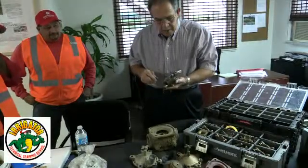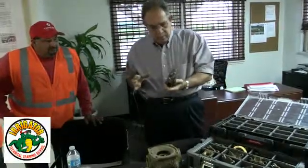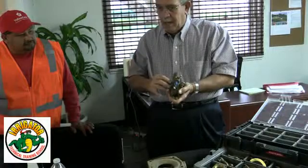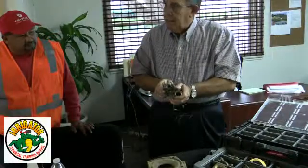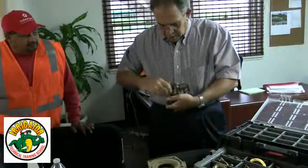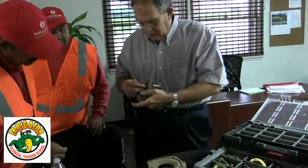So we've actually made a couple of enhancements to the block assembly. This is a DWS-PRV valve. Underneath the thread before it threads into the bonnet, we actually have a swivel, so this moves with no leaks. And we changed this piece on the regulator — we got away from the piston and now we have a diaphragm in here inside the regulator.